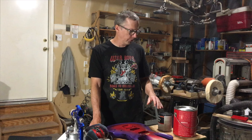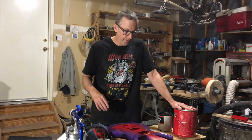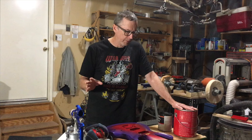In the last episode, I concluded my two-part series on how to select a spray system for your workshop without spending a lot of money. But the one thing I didn't talk about was what products I'm actually shooting from my spray guns. The reason I didn't talk about that was because the guns and the systems that I recommend can shoot pretty much anything that you'd ever want to run through your spray gun. You can use nitrocellulose lacquer, you can use automotive urethanes, you can use water-based finishes. It really doesn't matter. What it comes down to is getting the material thinned properly and the spray gun adjusted correctly to spray whatever it is you're going to use.